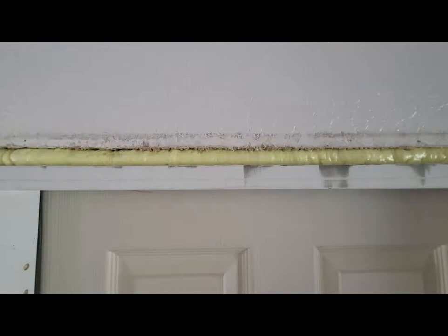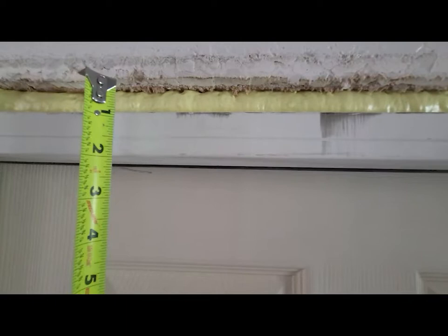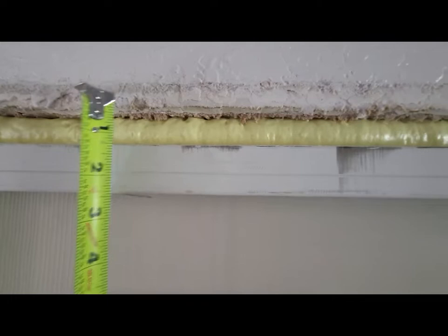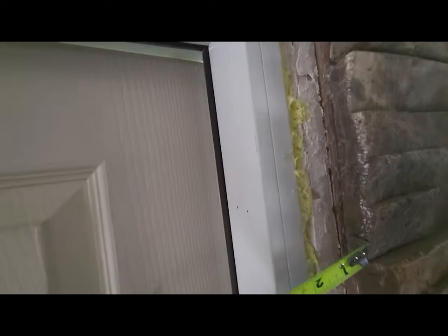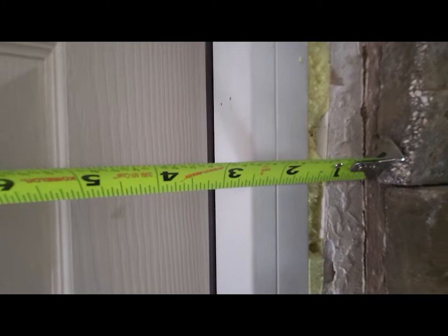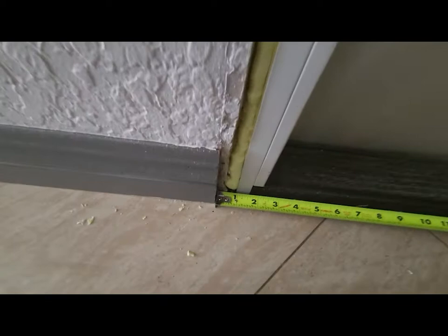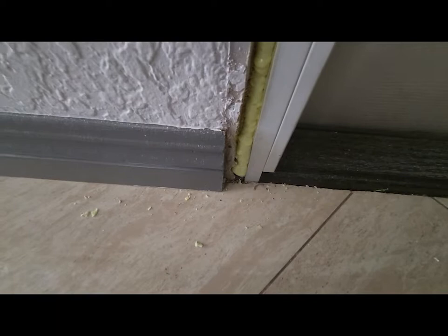Another challenge I found was because there was an extra gap at the top of the door, that meant I had to make the trim at least two and a quarter inches so it would cover enough of the drywall without looking weird or requiring drywall work. On the right side of the door frame I had basically exactly that much room, so that wasn't a problem. But on the left side there was molding on the bottom that came over about a quarter of an inch too far, so I wouldn't be able to get the two-and-a-quarter-inch door trim to fit on that side.